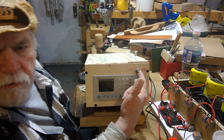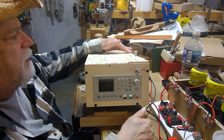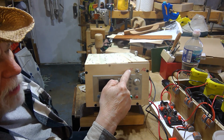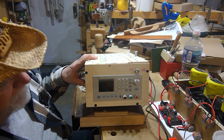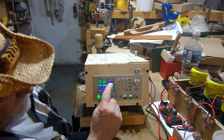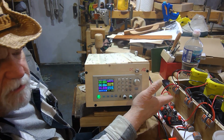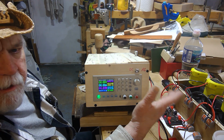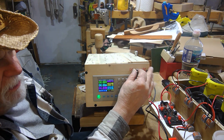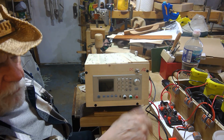So this switch here tells me whether I want to, whatever my power source is. If I'm plugging into DC power, I would move the switch this way, and then I would be running off of the DC power, like so. And now, because I am hooked up to DC power, it powers up, and I'm showing 59.7 volts coming in. So my 3 batteries in series is giving me that 60 volts. If I want, let me turn it off. So I go back to the center, and it turns off, no power.